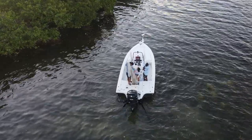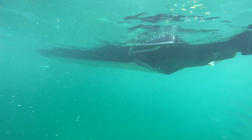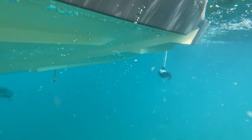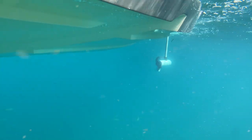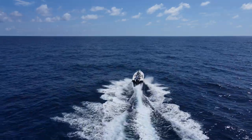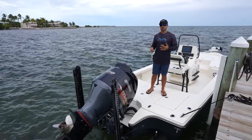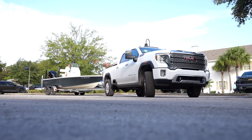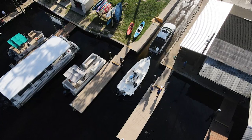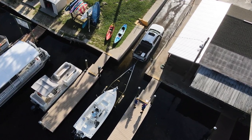However, there is a downside to a bay boat that drafts shallow — the bottom of the boat is going to be a lot flatter. You're going to lose what's called dead rise, and the more dead rise you have, obviously the better the boat is going to ride. So this boat is very flat on the bottom and it's not going to ride as well as a deep V center console. That said, it's a smaller boat, so it's going to be easier to trailer, easier to maintain, and ultimately just easier to run versus a center console because there's less boat to deal with.